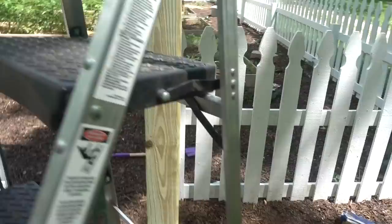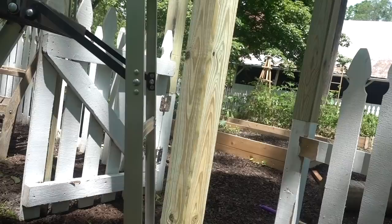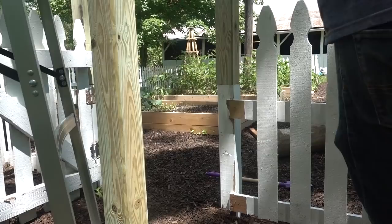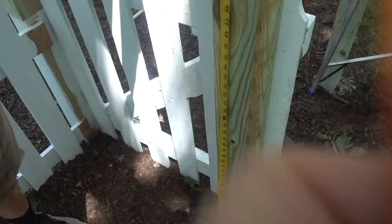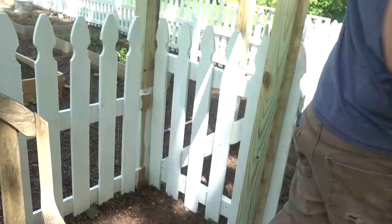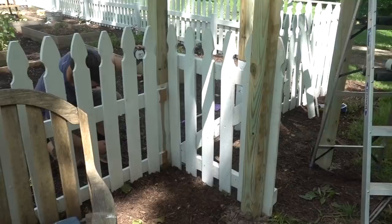You might have to inch over a couple of pickets to get that same spacing — the space created right now is too big; a chicken could get through or other things we're trying to prevent. We're going to take a one-by-four and rip it down the center into four pieces so we have little one-by-one square pieces. We'll mark the 20-inch and 10-inch points. Every 10 inches we're doing six pieces of lattice to go up this side.